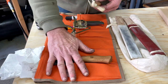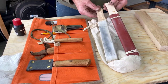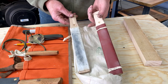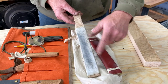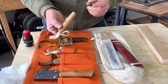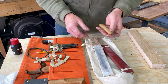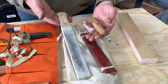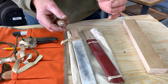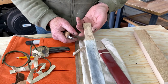I've even got my template for making spoons in there, so it's really handy to keep everything all together. As long as you're carrying your carving kit, it's probably a good idea to keep some means of sharpening it. These are pretty simple, lightweight carving tool sharpening sets — one with wet and dry sandpaper wrapped around it, and one with pigskin with some honing paste on it. A lot of the time, unless you've hit some really dry tough wood, as soon as you feel it's just lost that razor sharp edge you can sometimes just bring it back purely by stropping, without even needing to go to the sandpaper.